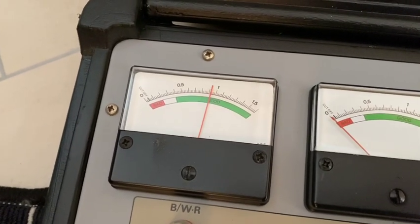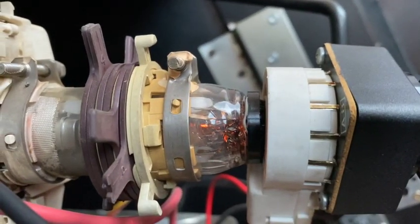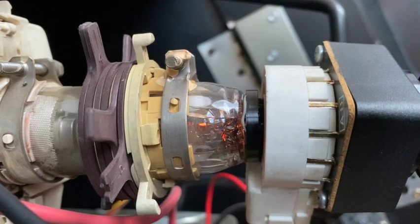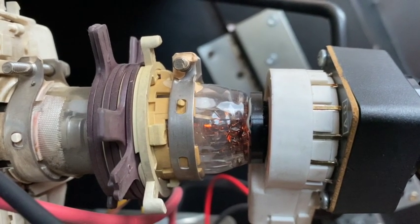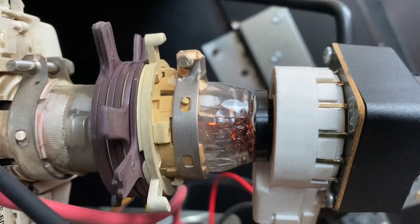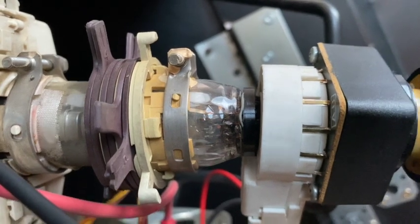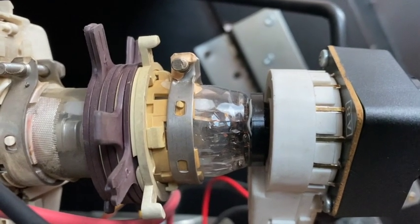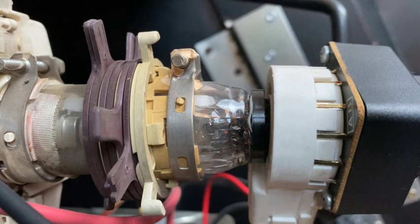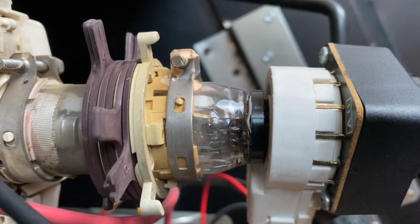And you can, during the rejuvenation process, and I will try to show you, actually see how the filaments are heating up extremely, and you can see sorts of very bright lights and flashes going on. That is actually when the particles are being fired off the surface of the filaments. So that is the theory behind the rejuvenation process. There's one problem with this process, however.